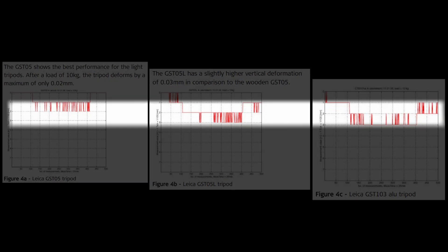Hovering between 0.02 and 0.03 mm. One could look at these results and note the Trimax performed twice as poorly as its Leica counterparts and draw some conclusions based on that. But let's keep things in perspective: even with twice as much weight loaded onto each tripod than the maximum it was designed to carry, the vertical deformation was only 0.05 mm — that's the width of a human hair. If I set up an instrument and it only sank a hair width over 35 minutes, I'm not complaining too much.